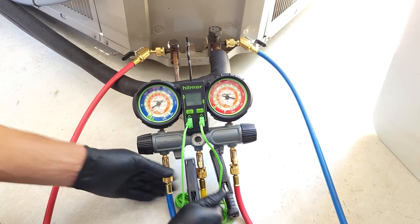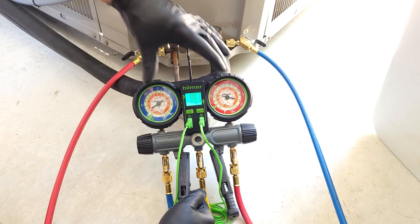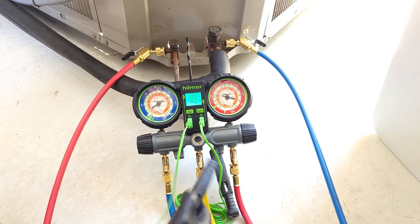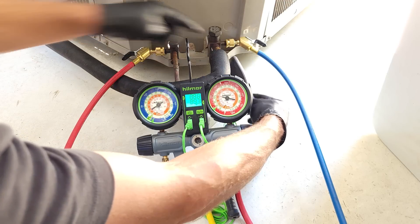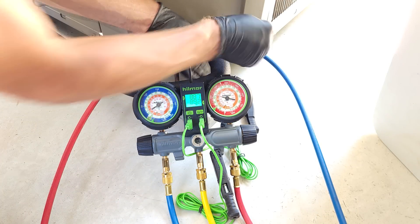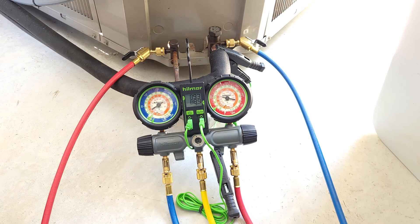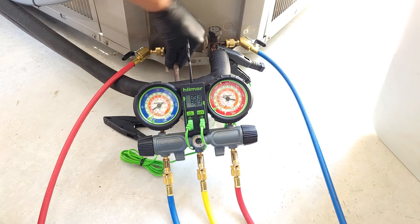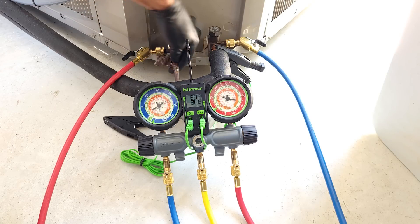We're going to turn our temperature clamps on and they should be very close to each other. Same thing with the gauges — you always want to make sure that they're zeroed out before use, depending on your elevation. On this side we're going to connect this to our vapor line, which is our large line right here. To make sure we have good surface contact, we're going to use some emery cloth. You want to make sure that's on a flat surface so it gets good contact with the copper. This one right here, we're going to connect over on our liquid line — just lightly sand any corrosion off the outside of the tube, as that may detract from getting a good temperature reading.